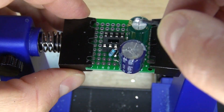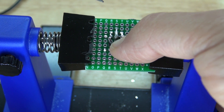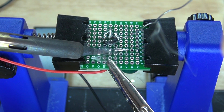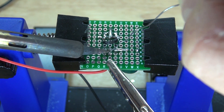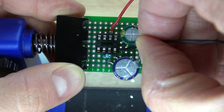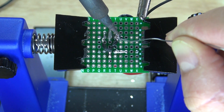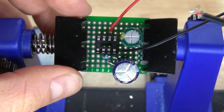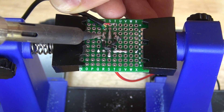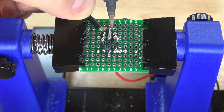Next, take your negative wire and solder it to pin 2, then solder it to pin 4. Take your 9 volt battery connector — connect the positive to pin 6 and solder bridge it to pin 6. Take the negative of the battery clip and connect it to pin 4 and solder it into place. Now take your audio jack — the green is negative and the red is positive. Solder the green negative to pin 2 and solder the red positive to pin 3.